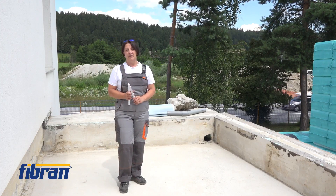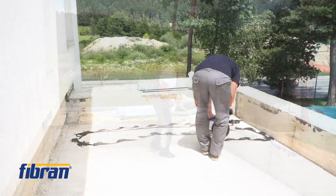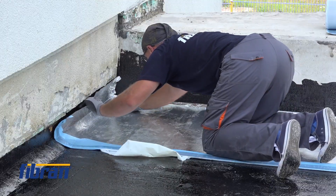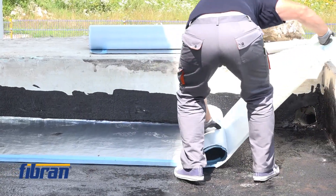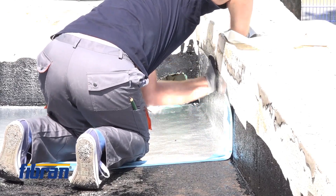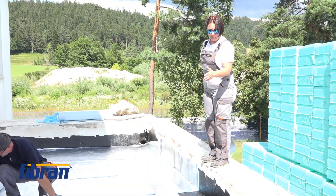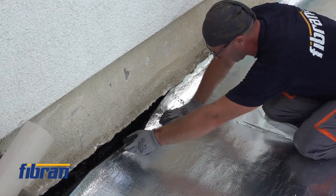When we come with the inclination boards, we shall make a nice, clean and smooth inclination towards the water outlet. The dusty surface was first treated with a bituminous emulsion. After drying out, we started a new phase of the refurbishment: this is the vapor controlling layer — actually the real vapor barrier — with aluminum foil on top of the bituminous thin layer. This membrane is self-adhesive; to improve adhesion, we apply it before it has dried out completely, but enough so we can continue.